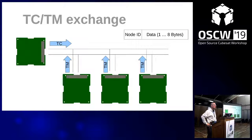The speed? The capacity? Oh yeah, the maximum is 8 bytes, that's what you can put in a frame. It's limited, it's not much, because it was intended to be used for reporting sensor data from the car, but you can come up with other ideas on how you segment larger data. If you have a command that is really big, maybe you split it up into a sequential sending of this command. But in fact, most of the commands that you're going to send are mode changing and switching on. So these are actually short commands.